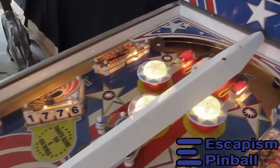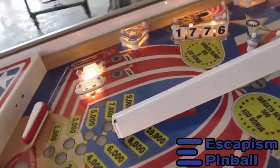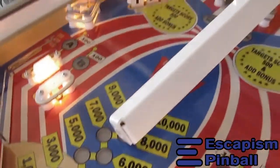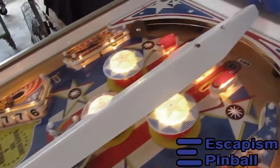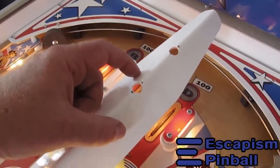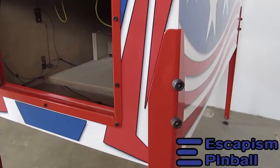This is a leg I make. It's tapered, looks a bit better than just the straight up and down ones. There's an M10 riv nut at the bottom so we can use locally sourced adjustable feet. And the hole spacing is compatible with the original machine, so we can use these legs on older machines. For leg bolts I use M10 socket head cap screws that go through with T-nuts on the inside, so if you strip one of them it's just a matter of changing a T-nut.